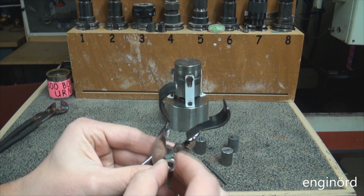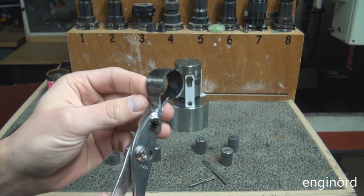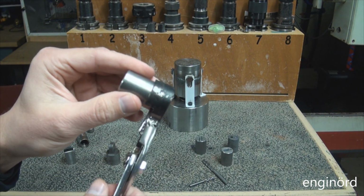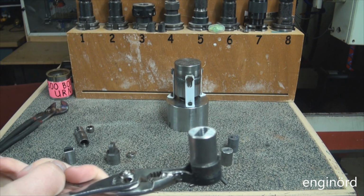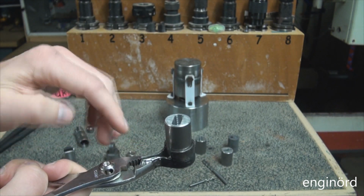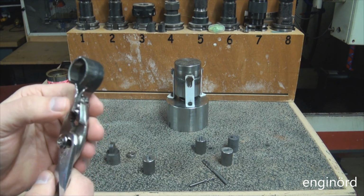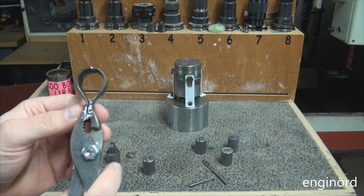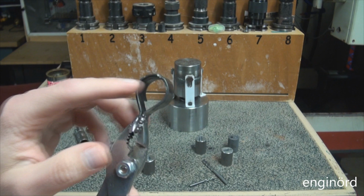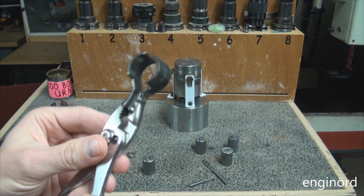And I also welded 2 tongs to it, and you can see how the tongs look. This is designed just to hold this part. So I can put the part in like so, and the coil is around right here. The coil is heating up this little cross section here, and it's not dumping so much heat. Well, the weld is not my most beautiful weld because these are dissimilar materials. This is just a soft steel, and this is some kind of alloy steel.